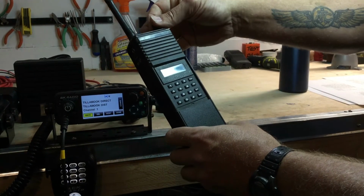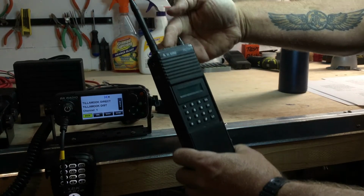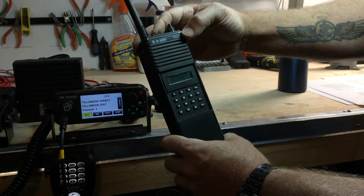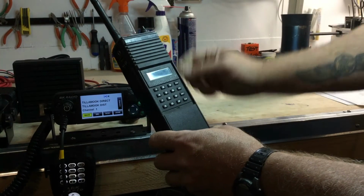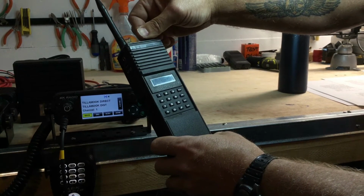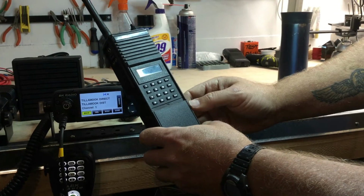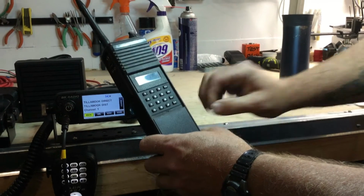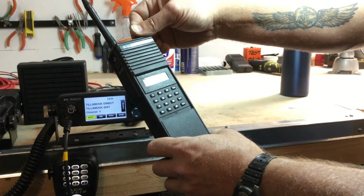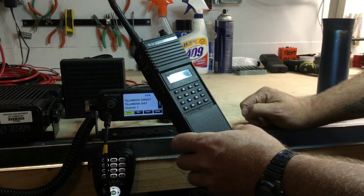All right, to add or delete channels from scan, what I'm going to do is I'm going to shut the priority switch off, bringing it towards me. I'm going to shut the scan off, bringing it towards me. These 2 top buttons are towards me now. As I go through this group, I can select channels via my channel knob, as you can see, going through the TAC channels in this instance. TAC 3, I'd like to add TAC 3 to scan. I'm going to press enter. SCN, solid, not blinking, will come up above TAC 1. Okay? As I cycle through to the next channel I'd like to add to scan, I press enter again. TAC 8 is now in scan.